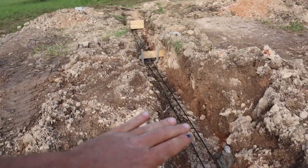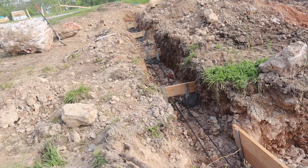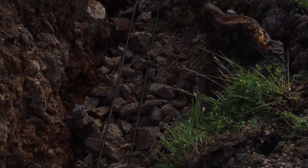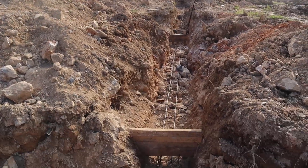You can see our steps: flat, step up, flat, step up, flat, step up. We stepped up along the back too because the hill goes up in both directions. Probably one of the most annoying things I've ever done was stepping up the footings. Here's this side — four steps. We have all our rebar in. I didn't put the three-quarter trap rock like we usually do because I have so many rocks from digging — we just threw in a whole bunch of stone, tamped it, and that's good enough. Literally the same thing. Here's the middle.